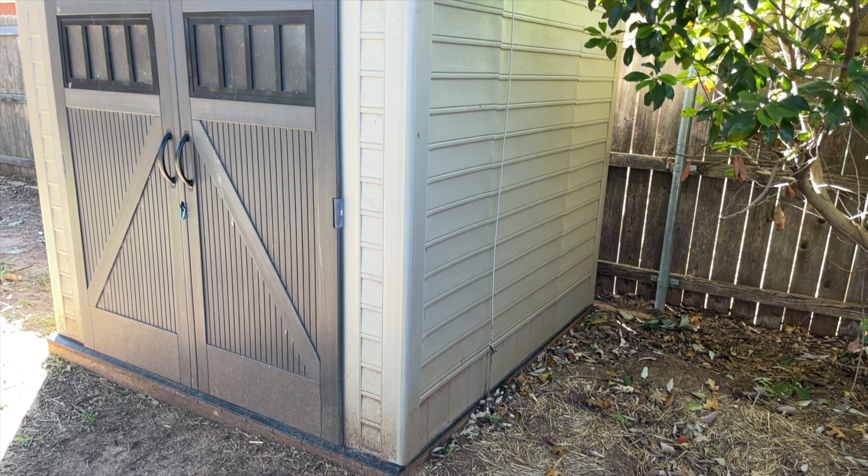You can see I've got a little crack here because the corners and the pitch of the roof are actually two panels that have a bend in them. So it's actually a weak point where that plastic tends to split over time. That is also the southeast corner and it gets a lot of sun, so there's a lot of UV exposure right there.